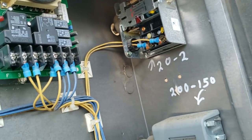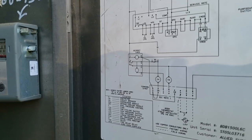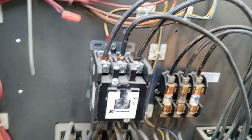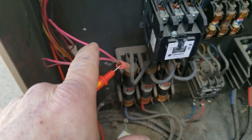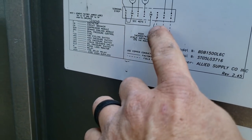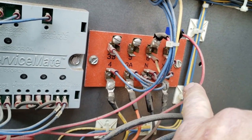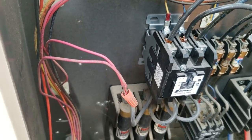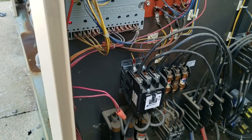I've got 200-some odd volts on my N and 4, so it's coming out of the clock. If I can find terminals 5 and 6, I might find the thermostat, and that's probably where our problem is going to be. The one that was missing — the dummy terminal — I'm assuming it's this one here because there's nothing on 5. Checking between 5 and 6, I have 214 volts. So we need to go inside and check — it seems like the thermostat is not calling.